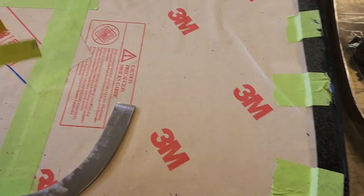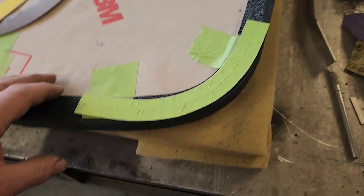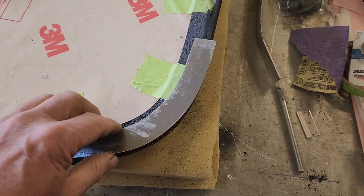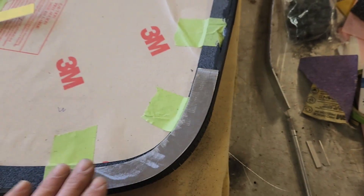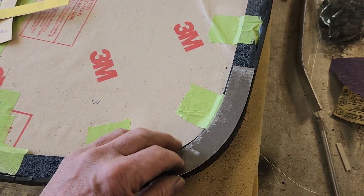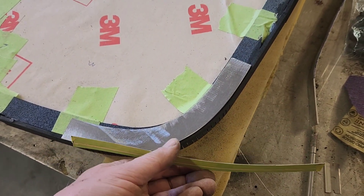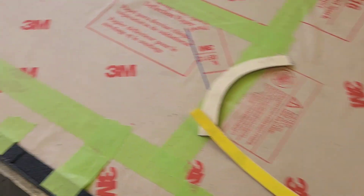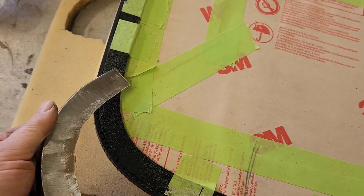The way I've done that is to take a paper pattern, lay it on top of the corner, get it aligned, and then take the metal piece - 70 thousandths mild steel - and just lay it in so that it follows that contour. Keep tweaking it until it drops down in there and sits without any pressure. Then come around and make another paper pattern to band the outside that fits this. And you end up with a finished corner that looks like this - where the glass will lay on the inside once it's all done.